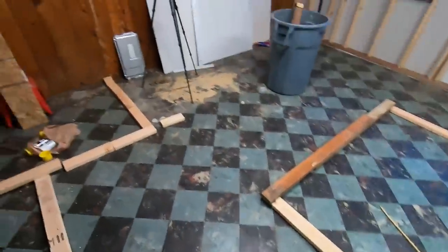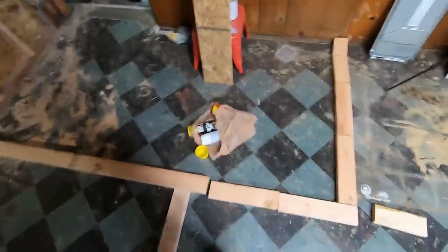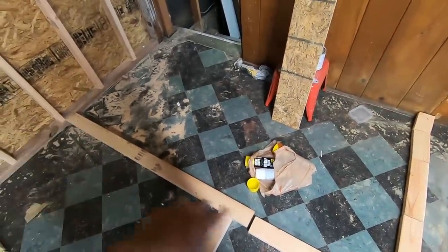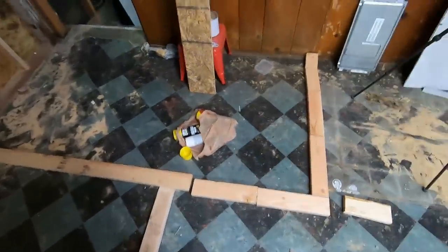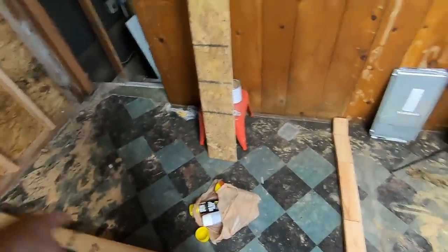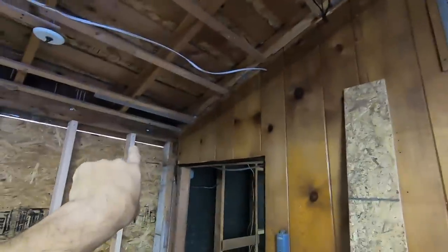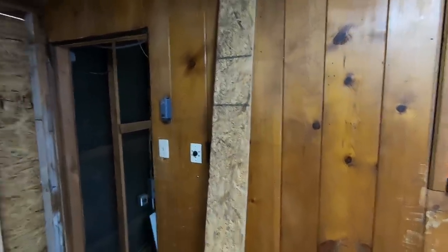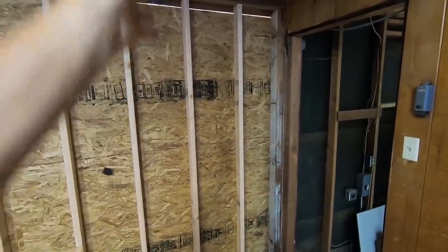Now for the closet — there's a nice walk-in closet right here. The door will swing in. I thought about a pocket door, but this wall is all tile and I don't want a floppy wall for that. The closet is 48 inches wide by 8 feet, and probably 10 feet at the top. There'll be shelves above the door and across the whole back wall. Two 8-foot runs of hanging gives you 16 feet to hang clothes. You can put a full dresser in, shelves on this wall, and continue hanging in one direction for longer clothes.